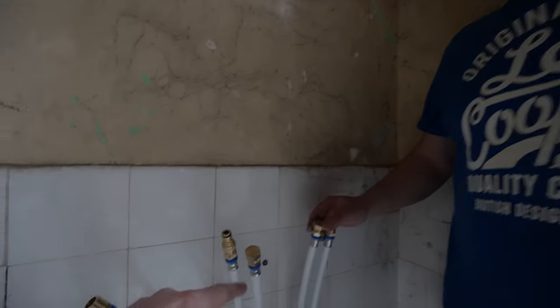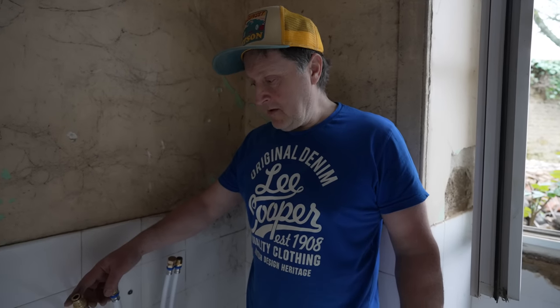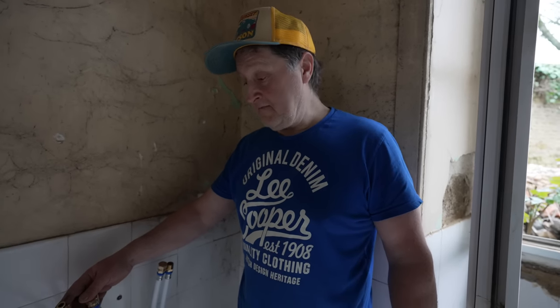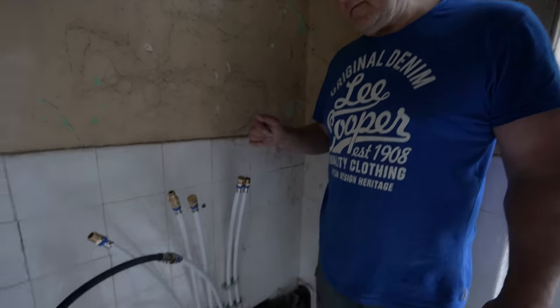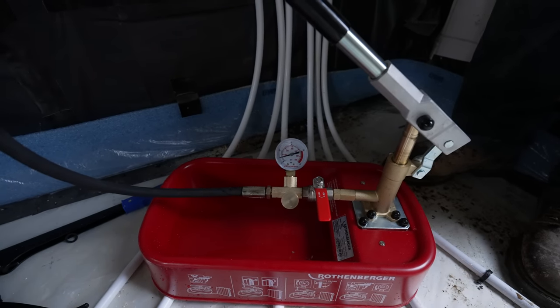Ready to get the pressure on Sean? We thrive under pressure! I've done two circuits already. We've been filling the pipes up with hose pipe so they're full of water, then putting caps on one end - blanking them off with a special plumbing washer so they don't leak air or water. Zone one we left for about half an hour and it's fine - didn't change at all. Zone two is currently on and we're at about five bar, been like that for about 15 minutes.